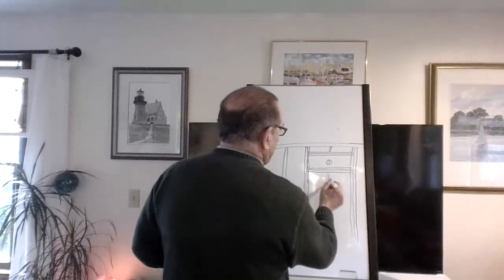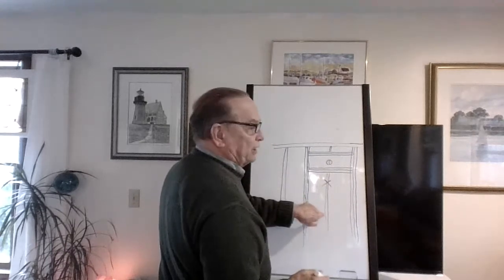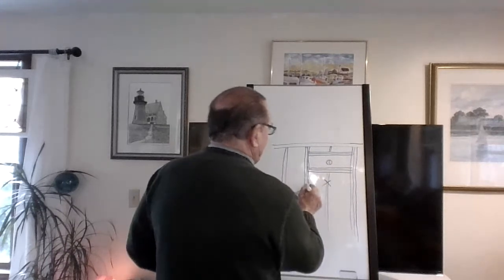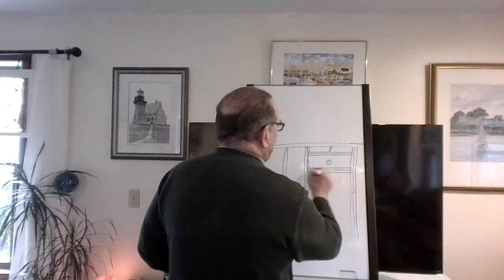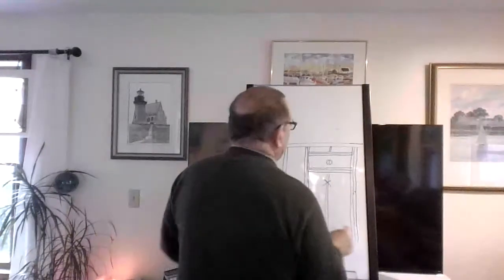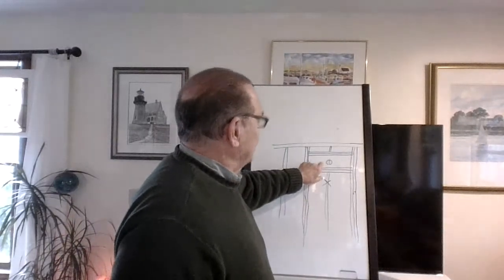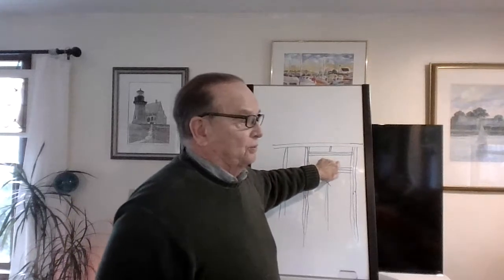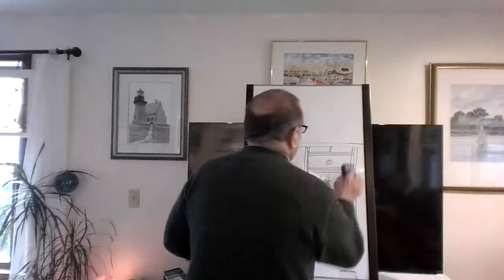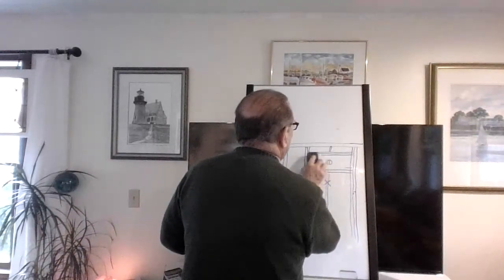All right, the reason is because with this out, which has been cut out now for all practical purposes, this is holding up nothing. This has to pick up 50%. That picks up 50%. So it's called the header, and I believe this is the trimmer. Again, those names don't really mean much to us. But this is a big deal because I had a company who knew where the water closet was going, and they used to do this for me. I don't think this was doubled up. I'll take this back. Like I said, it's been a while.